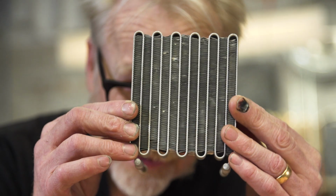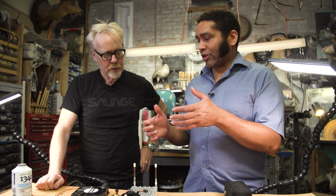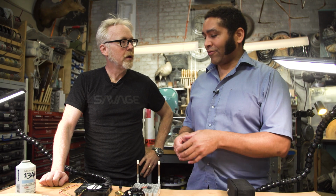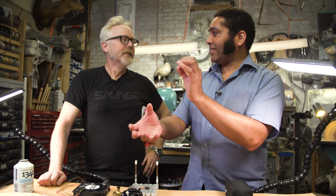And the larger the heat exchanger for a given amount of gas that we're trying to cool, the more surface area we have to cool that gas, and the less air that we need to blow over any given surface. Got it. So the bulk airflow could be the same, but the bigger fan I make for a given amount of airflow, the slower and quieter the fan can get. So if I have a really tiny fan and I'm blowing, say, X number of CFM, I have high velocity and it's loud.